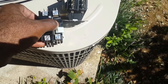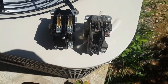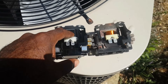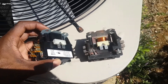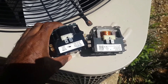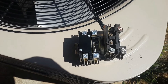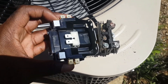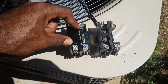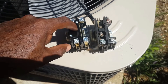There are the same number of pins — eight on the bottom and eight on the top. I only had two wires connected. Also, the new one is enclosed, so unlike the old one where you can see the coil from both sides, the new one is sealed up entirely. This was done because bugs can actually get into the contactor and cause problems. However, you can remove these two screws and the plate will come up, showing the same internals underneath.